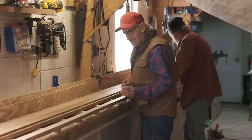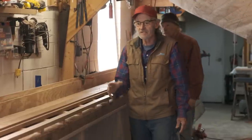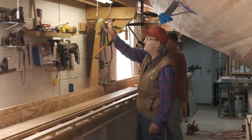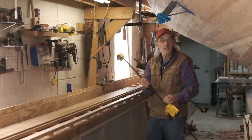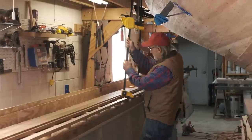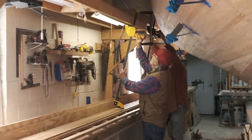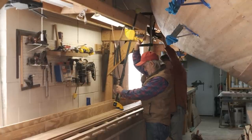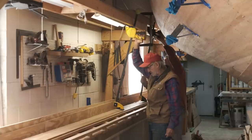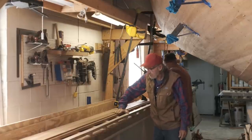And when we got faced with it, Ken came up with the idea, the same idea that we were using to squeeze the planks up tight with these bar clamps pushing. We're doing the same thing right here. We put the clamp on the batten like that. You slide it up there like that, and there you go. Just like that. Now that is down nice and tight.